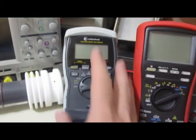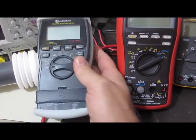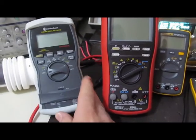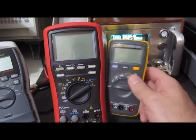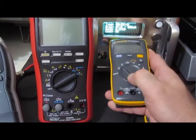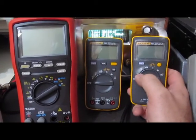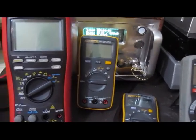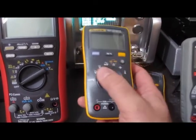The other wild card is this Radio Shack. I don't think anybody expected this Radio Shack to survive as well as it has — it just keeps hanging in there. It does reset; I'm surprised it hasn't taken out the front end, but it just keeps ticking. I don't think anybody questions whether the Fluke 107 will survive — we probably all assume it's going to. I would imagine it's roughly the same type of front end design as what's on the Fluke 101, though I haven't verified that and I've never had the Fluke 101 apart. But I think we still need to run the test and prove it out — that'll be the next step.